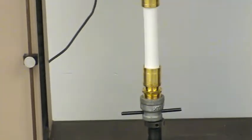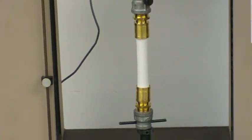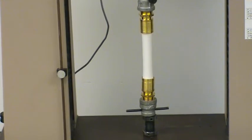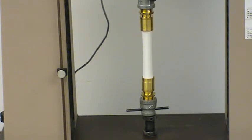The actual free length of pipe that's not captured inside the fittings is about 4 inches between the fittings. So as we measure our percentage elongation to break, we're going to be comparing against that 4 inches of free length of pipe.